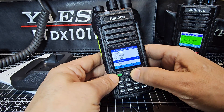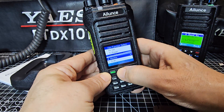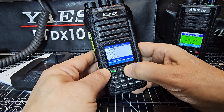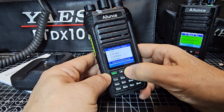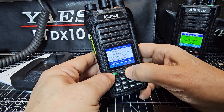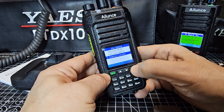You select from a list of side key function options: No Set, TX Power, Squelch, Monitor (which is squelch off), Scan, Zone Up and Down — zones on these are not DMR but essentially groups — FM Radio, Talk Around, Emergency Start, Emergency Stop, and Operational DTMF Codes.